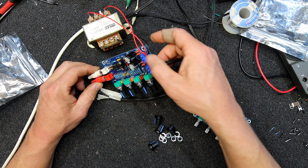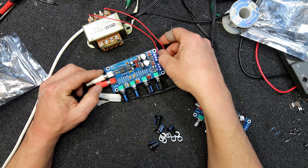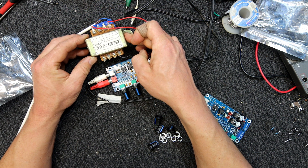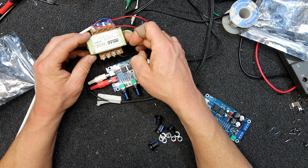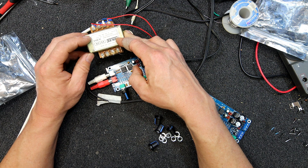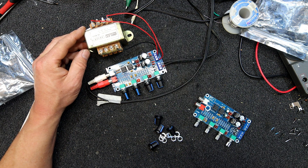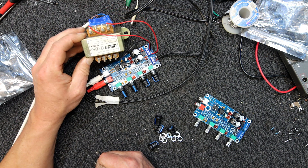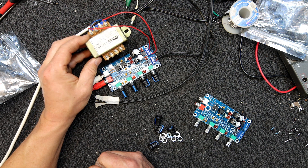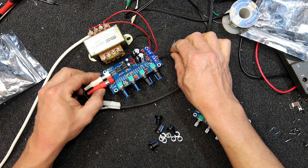The other thing you'll need is a transformer — it needs 30 volts centre tap, so 15 volts each side. I've got this old Arlec transformer; these are really common ones that Dick Smith and Jaycar used to sell, going up to 30 volts at various taps. One amp is more than enough for this — it would probably run on quite a bit less. It looks like Jaycar now only sell a two amp version for about $33, whereas these used to be about $15.